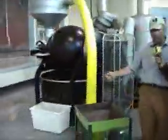In here, we're going to roast the beans and then winnow them to take the shell off, and then do a final roast to develop the flavor. The beans are brought in, they're dumped into this blower, which blows them up into the hopper. The hopper then feeds the roaster, where we do a pre-roast. It's about 10 minutes, usually not hotter than 300 degrees.